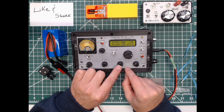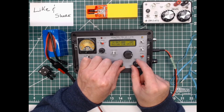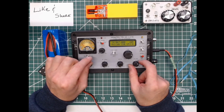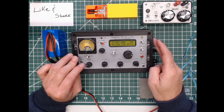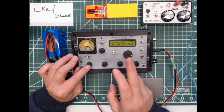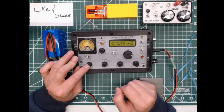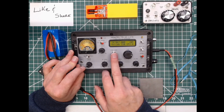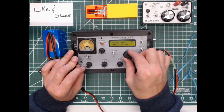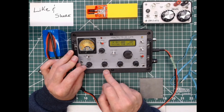Okay, you also have a notch filter. Okay, not sure how well that's coming out through the speaker, and I'll hook up an antenna here momentarily, and we'll do that again. This switch that's in the middle, if you get to a frequency and you don't want to bump your knob and change your frequency, well, press up and it puts the dial lock on. So now you can move that knob and nothing will happen. You need to unlock your knob, press it right back up.